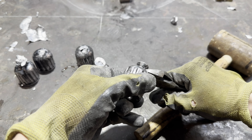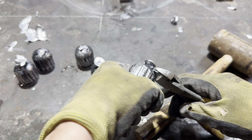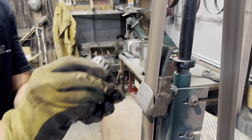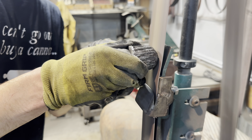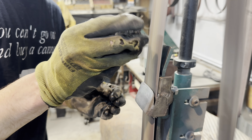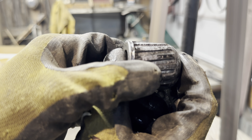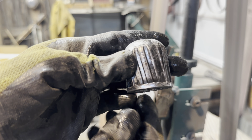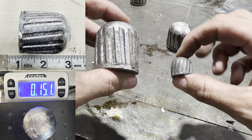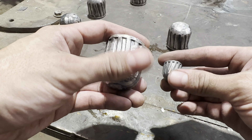I know you guys don't like it when I use the angle grinder to remove the sprues, so this time I figured I'd just use some wire cutters and snip them off. Although I am going to have to use a sander to get the top of these completely rounded again. The last step is to hit it ever so slightly with the orbital sander to remove just a little bit of lead on the top where the sprue was attached, so we get a nice smooth round surface. I'm wearing my respirator, so don't worry about that. Here's a good close-up look at our Foster slug - you can see some soot still left on it, crispy beautiful rifling lines. And here's one of the finished Foster slugs next to a 12-gauge Foster slug. I think Justin nailed the design and PCBWay nailed the mold.